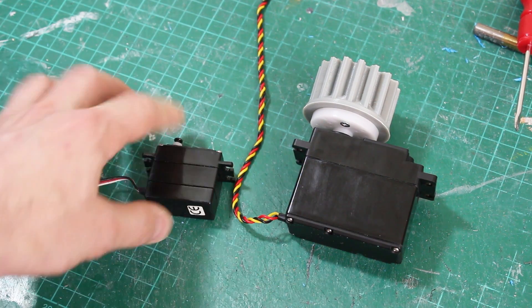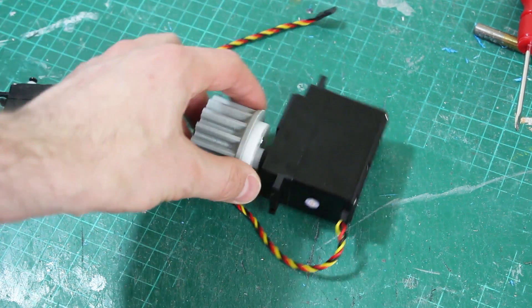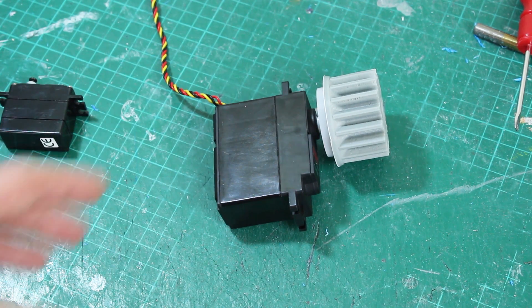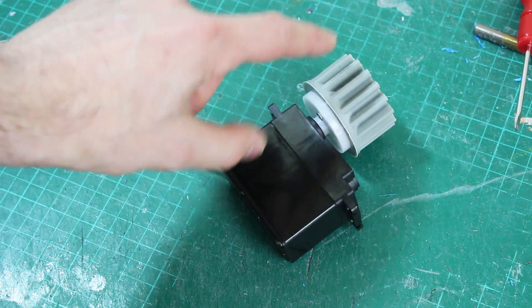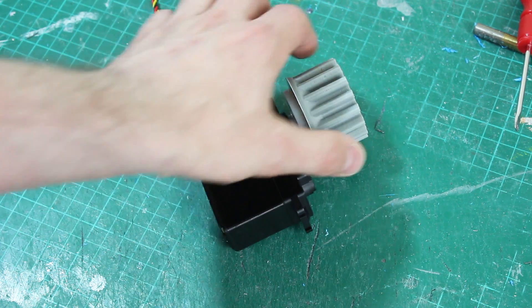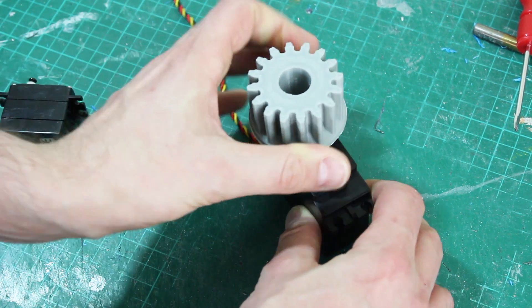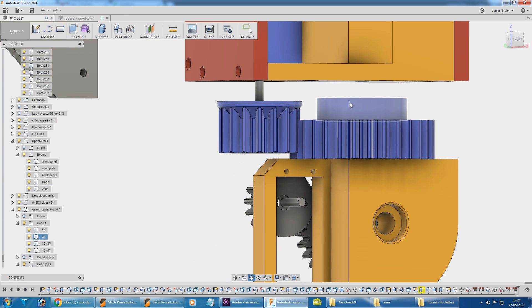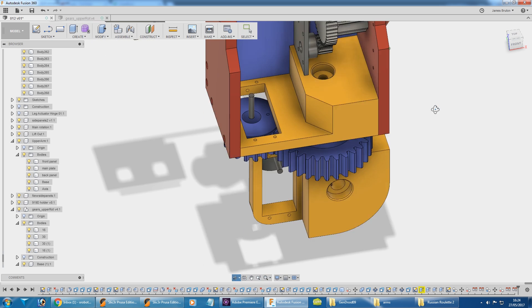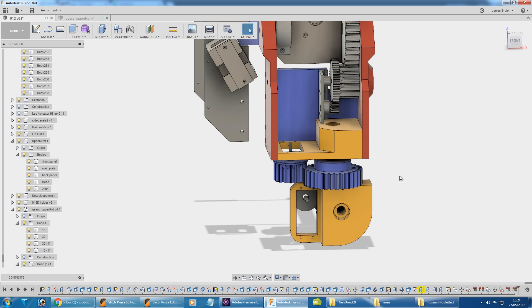Now we need two more axes: one to take the arms outward and the elbow as well. The motors for those axes are going to be these servos - quite bigger than a normal RC servo, these are jumbo servos, the Hitec HS-805BB+. These are the same ones I used in Ultron's head and BB-8's head, and the same motors used in the Inmoov project. I'm not putting the joint straight on the servo axis though; I've got a gear attached to the servo horn to drive another gear and give a 2:1 reduction. The servo does 180 degrees but we really only need 90 degrees for those joints, so gearing it down makes a lot of sense.